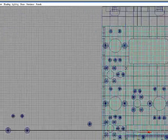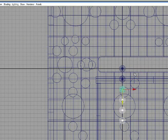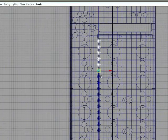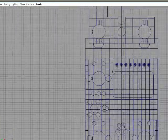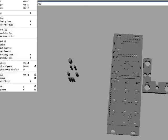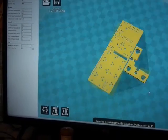There is basically no wiggle room there. The large hole for the SD card must be traced to cut as well. Sometimes I will reuse the panel PCB template to drill for the headers in the motherboard, but sometimes I need to make a separate template if using a breakout or development board for the processor. Lastly, the header positions are decided. They must be in a convenient position to run traces or wires to components, but also offer some support. More often than not, these header positions will remain through to the final product as they depend on the panel face, which probably won't change much.